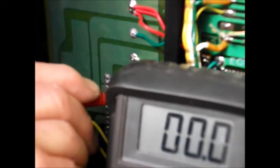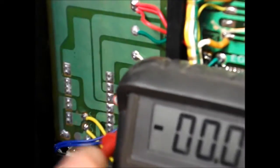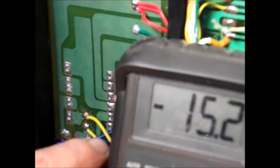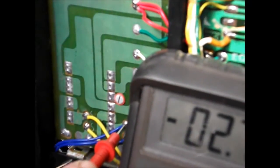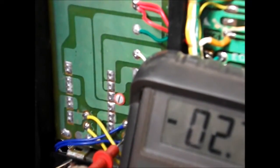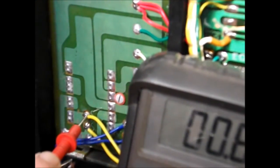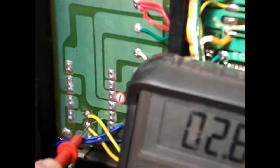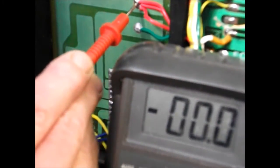Next one down, the blue ones — it looks like negative 27 volts — that's acceptable. And the green ones down here are reading 15.5 volts each, basically. Then we've got two blue leads and two yellow leads over here. The blue leads: getting 2.0 on the top one, 2.0 on the right one. Yellow top: 2.7, and 2.5. But I think these are okay. I think the problem is that we're not getting 12 volts where we should be.